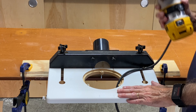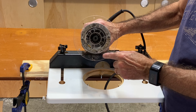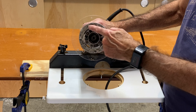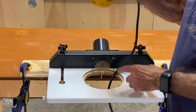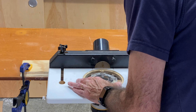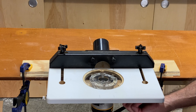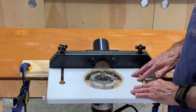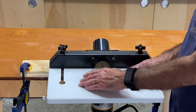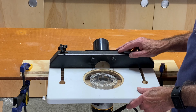When you buy this little router table, it comes with its own base plate for your router. You just take your old base plate off and put this one on. You can see all the holes in here — it's pre-designed to fit just about every trim router out there. All you do is feed your cord down through the bottom and this will drop right in. There are three set screws you can adjust from the bottom to raise or lower the base plate, ensuring it sits nice and smooth with the top of the table so your wood slides right across. Those little adjustments work just great.